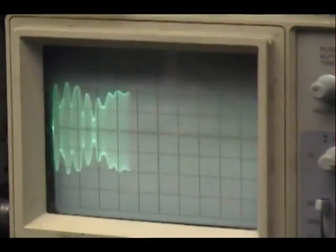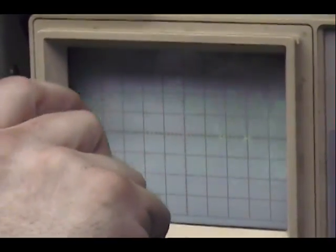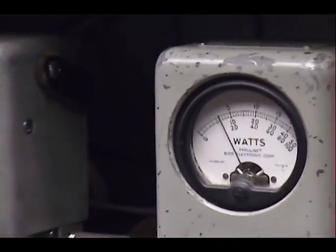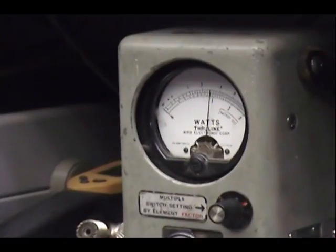But you see, I've talked to people before. You have a 400 watt radio. It's supposed to dead key 100 and swing to 4, not 200. You see what it does to your audio? It sounds really tight, and it's not very responsive right here. It just kind of goes down. It doesn't bounce up a whole lot. So the AM audio really should be this out of the box if they properly set it to 100 watts right there.